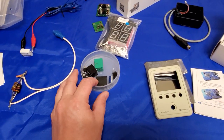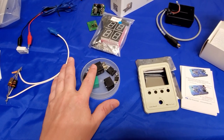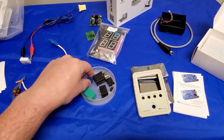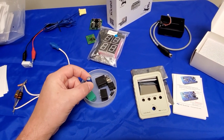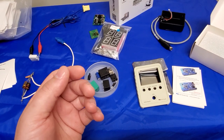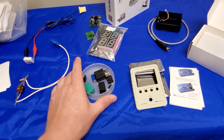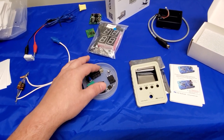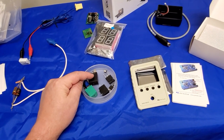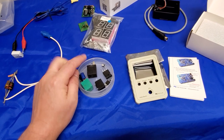Some of the other things we do — you can see right here I've got a tin of various failed components. I've got relays — you can see three of them — and some electrolytic capacitors. Each of these has some pretty good signs that they're in the process of failing. It's a physical example of not only what failure looks like, but how the component functions. We can actually measure these. If you're working on a board and you've got a failed relay, there are certain things to look out for — it might click when you apply power, but that doesn't actually mean the contacts are making.